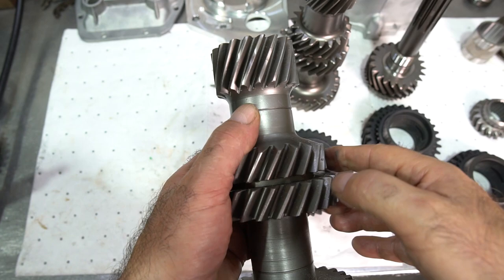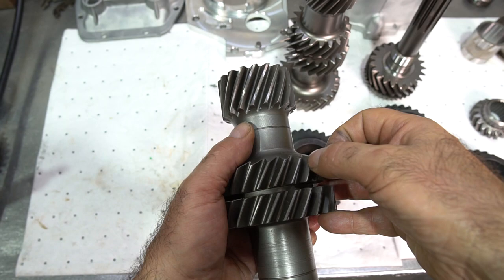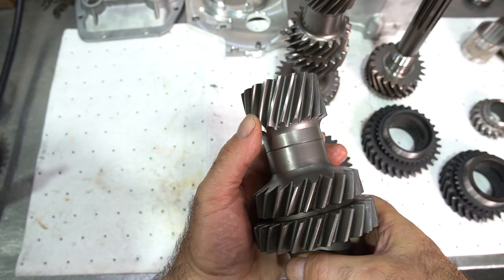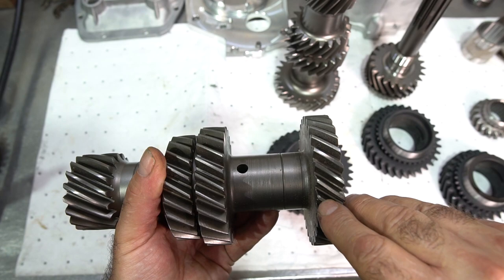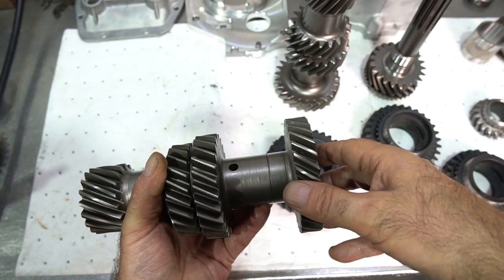It's permissible to cut these down because the tooth is really contacting the center portion or root of the tooth. Usually it's okay to clean these up, but sometimes they're so badly banged up they're not usable. This is usually due to poor handling and poor packaging — a lot of poor material handling happens all the time. When I sell gears I have to inspect every gear; I don't leave them in the original boxes. Some gears probably got banged against each other on a cart right from the factory.